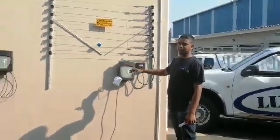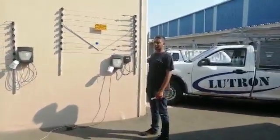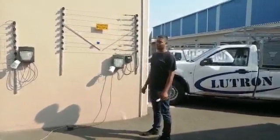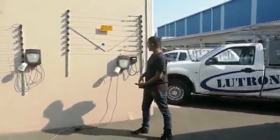However, if you have a big fence like an 800-meter fence, you can't use one energizer — you'd need a two-zone energizer or two energizers. Some guys use a single energizer and connect the fence in parallel, and that's when you start having issues. I'm now going to demonstrate this by cutting the live wire.